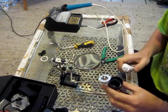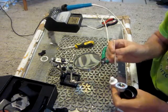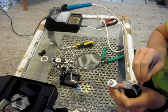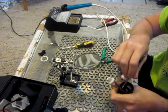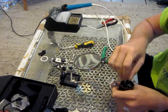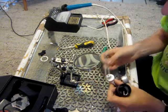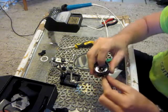The next major thing to do — and this is much easier with the little syringe I gave you — is to put a little thermal paste on the inside of this system right there. You want as much heat transfer between the LED module and the inner body as possible. You can use an earbud for this. Put a little bit of thermal paste on the inside and then gently pull the wire and slide this little module right back in to where it should be.